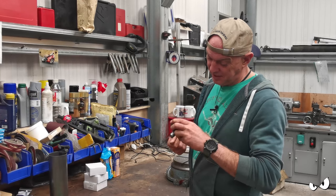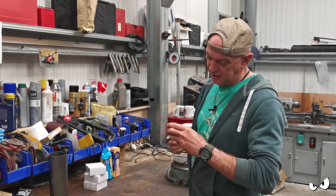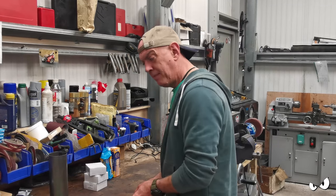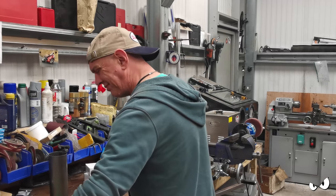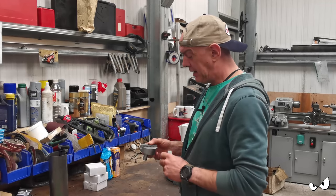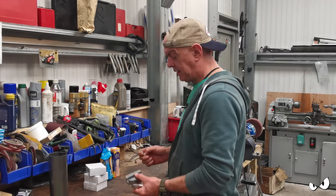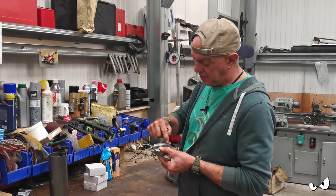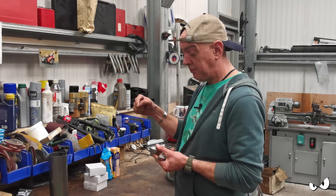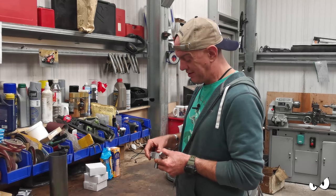So I've got my set screws in, which is sweet, and they all thread down quite nice. So that's cool. I did make a cock up, as you saw in the other video, when I did this slot. Basically, it is a tiny bit big. The cutting edge needs to be on the center line. The grub screws are this side, so they're essentially pushing the tool away by however much I cocked it up by.